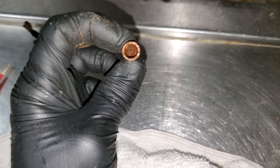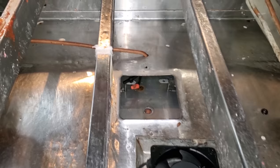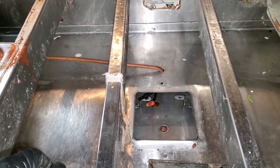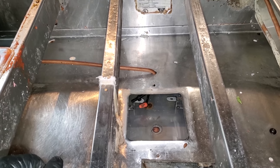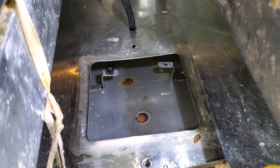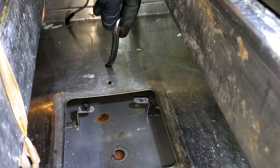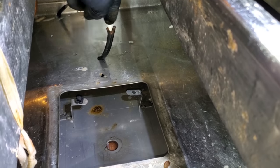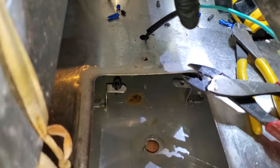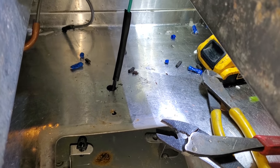It's a bad connection — you can see it's just corroded. The only problem is it's really tight to get in there and strip those wires. That's what sucks about these units — there's no play. Hopefully I can get in there and strip it; if not, we're going to have to run new power, which will be a nightmare. I'm trying to figure this out — that wire is so short, but I was able to pull it up through there so I can get it stripped. Once I get it stripped, I'll put connectors on it, push it back down through very carefully, and have a long connection. I'm doing it one wire at a time — a butt splice, then heat shrink — then push the other wires through.